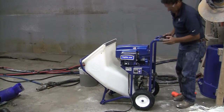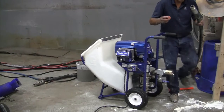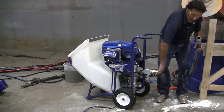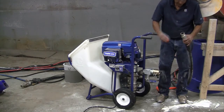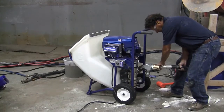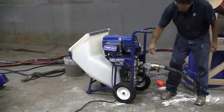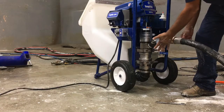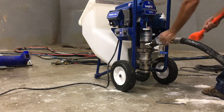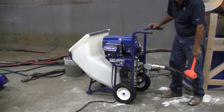We're ready to run the sponge. Put the safety assembly back on. Always put your sponge in the hose — if you put your sponge in the manifold, it will stay right there and the water will run right by it. It does it on big pumps, small pumps, any pump you ever use. So always put it in the hose before putting it on. Never hit the clamp ears with a hammer — they'll break off. If you're having a hard time getting the clamp on, simply bump the opposite side of the hose and they go on very easily.